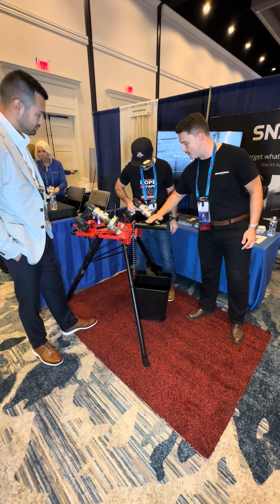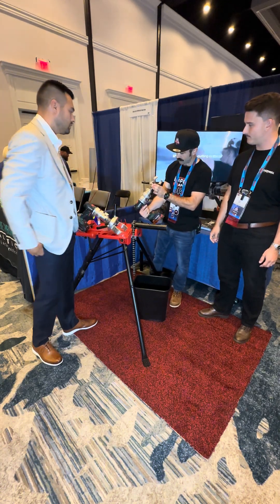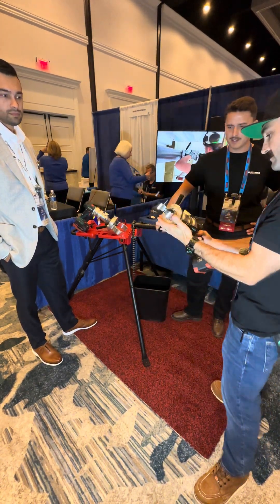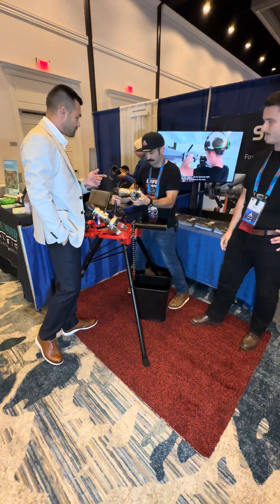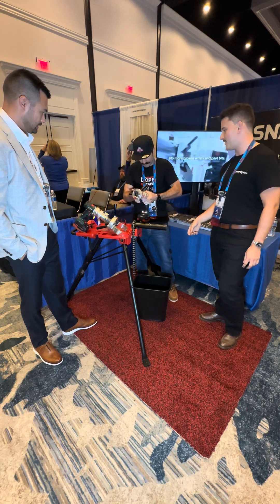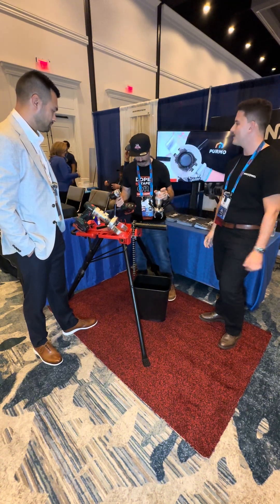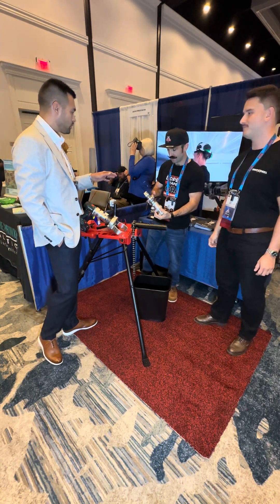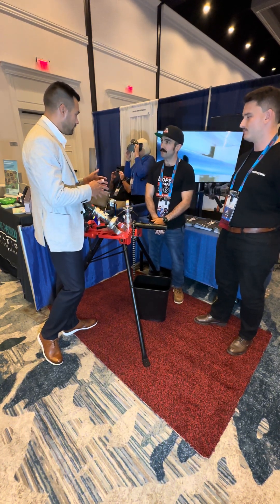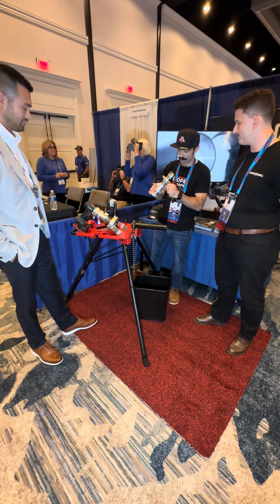And the result — you'll notice I'm not using gloves for this — it's a clean cut. Anything better than a punch or a weld can do, it's a nice clean cut. Here's the difference between this and standard drilling: with standard hole drilling, you can get between 15 to 20 holes out of a hole saw. With this unit, you can get upwards of over 400, if done correctly. 400! That's impressive.